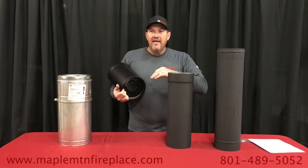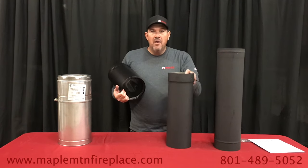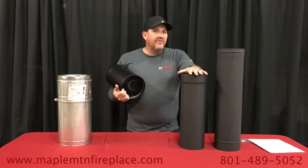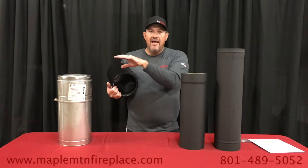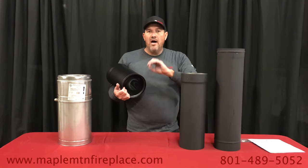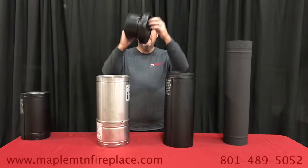The collar size could be an odd size — it's usually six inch or eight inch. If it's about five and a quarter inches, that is a European-made product and you will need an adapter. There are also some older stoves with a seven inch collar, but for the most part everything in the US today is pretty much six inch, with a few options for eight inch.